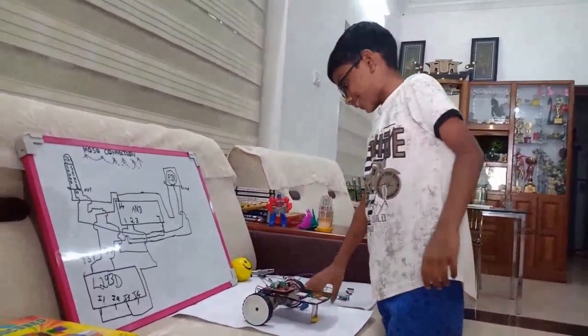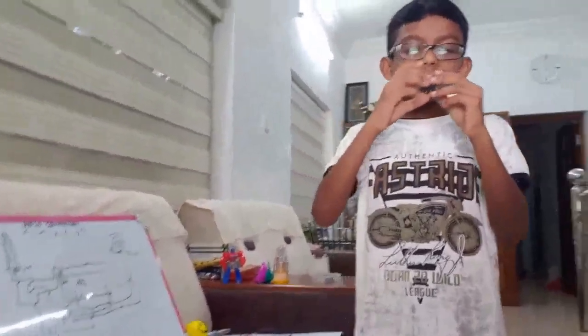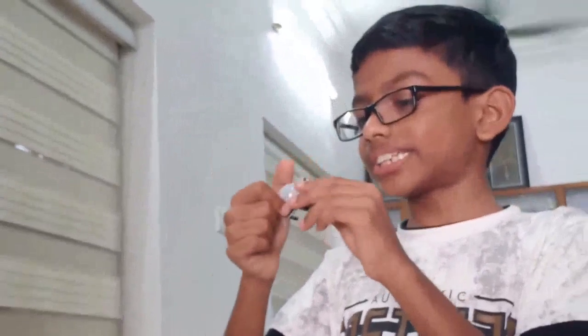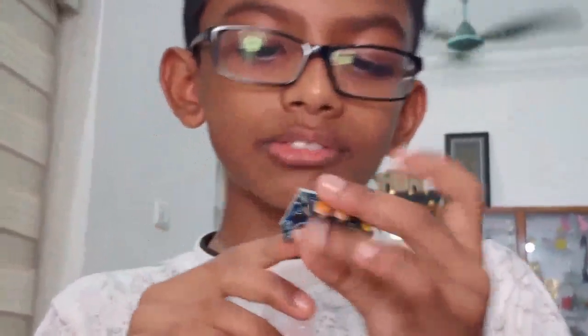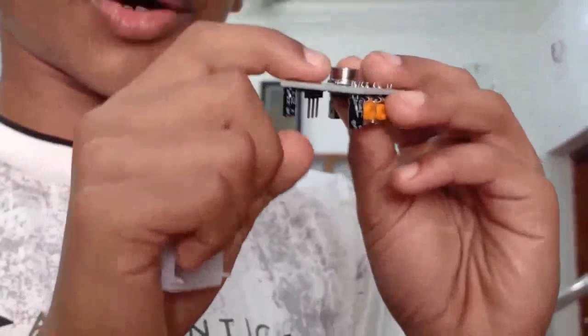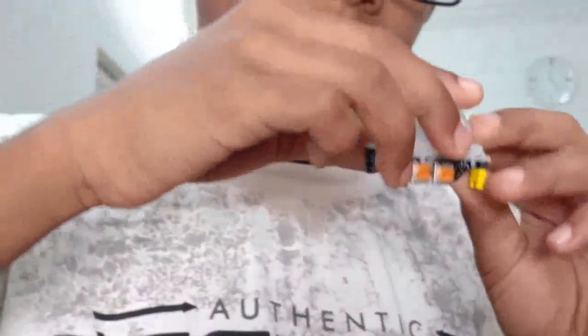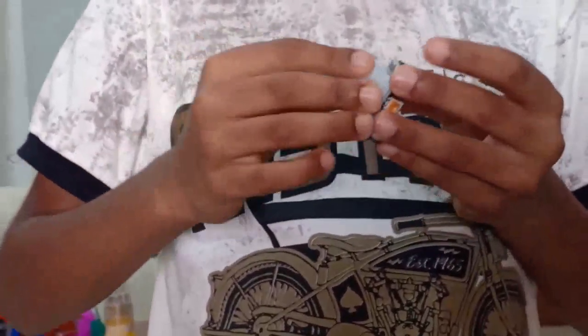And for the grand finale, we have the motion sensor — that is a PIR motion sensor — and the sound sensor. As you can see, you can adjust the timing and the radius. If you open it, this is the real sensor. In all motion sensors, the middle pin is always the output, the left is ground, and VCC is on the right.